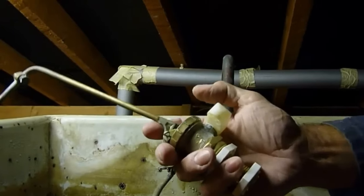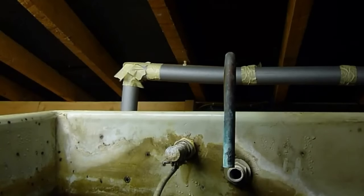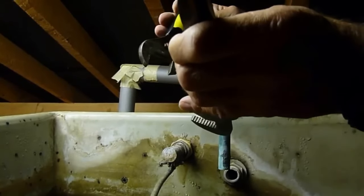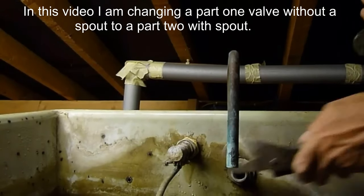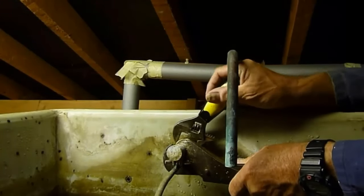So let's get to it and change this ball cock. It's very easy — you don't have to take it out of the tank unless it's really tight and the nut doesn't undo. Basically you just need two spanners; I prefer footprints and a little open adjustable. Put your footprints on the bottom and put your spanner, adjusted to this nut here, and twist.